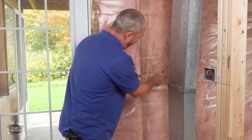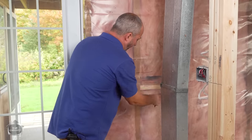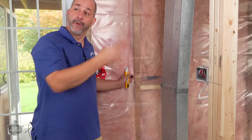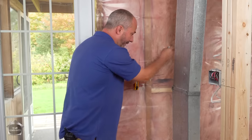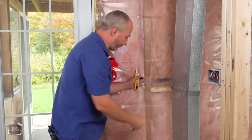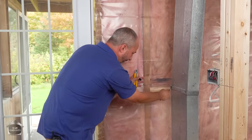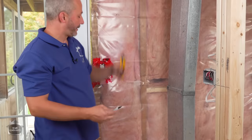And then once you get that done, you can take this insulation and just lay it in behind the board because there's just enough room because of the old framing, right? It's an actual 2x4 here. So this R12 won't be compromised if you put it in behind this. And that'll give it a much better seal because by going underneath, you're compressing behind it, but you're creating these gaps. You see that? Right? Where the cold air will come through.